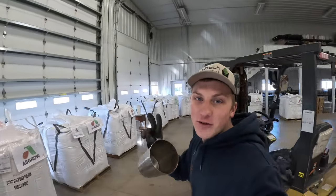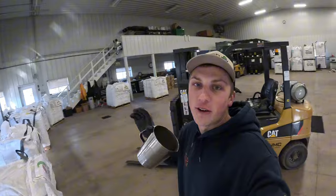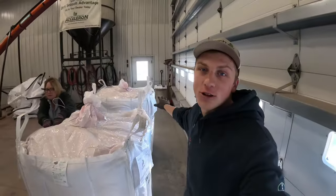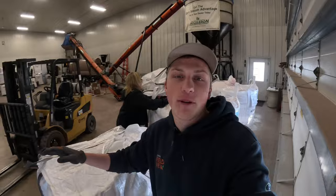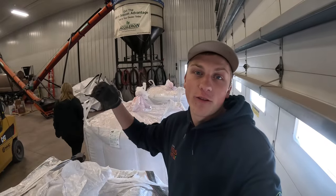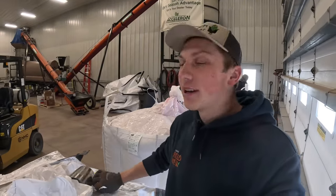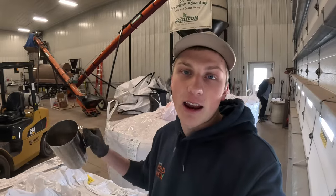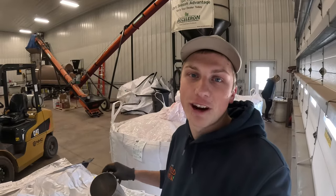So far mom and I have just finished our first two bags of treating of a 14 XF4, a 1.4 maturity soybean. Those are these two right here. The next three we need to get done are a different lot number, meaning they came from a different farmer from the previous growing season, which means they have a little bit different seed size. So I'm going to take a cup sample and get a weight of a calibration container out of this different lot number so we can program them into the treater.